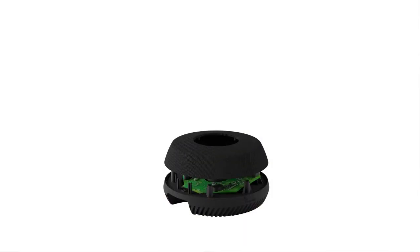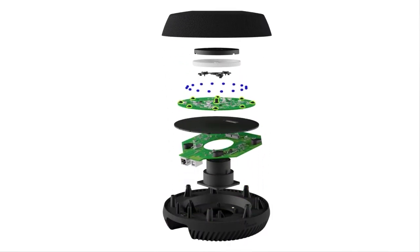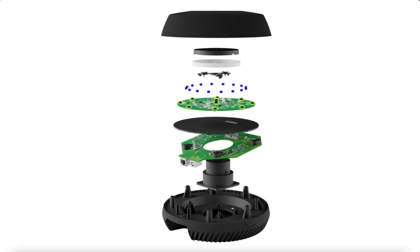So tell us a little bit about the speaker and why it's so special and easy to use. It is a speakerphone, so it does have both microphones and a speaker — nine beamforming microphones and a downward-facing speaker. It was specifically designed to create enough separation between those two components so there would be no echo. On top of that, there is a DSP chip running algorithms for echo cancellation, noise cancellation, automatic gain control, and all sorts of really cool stuff.